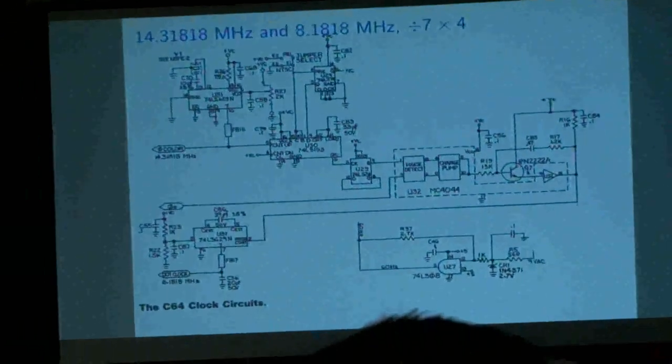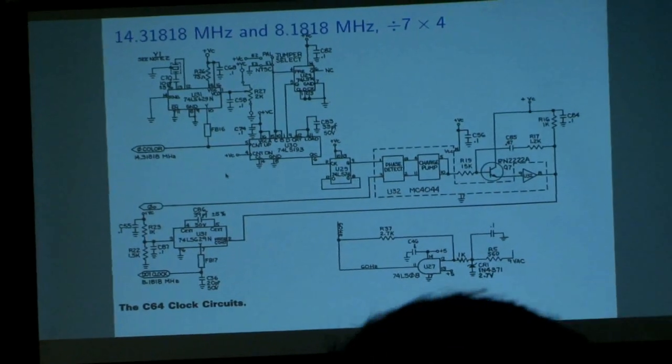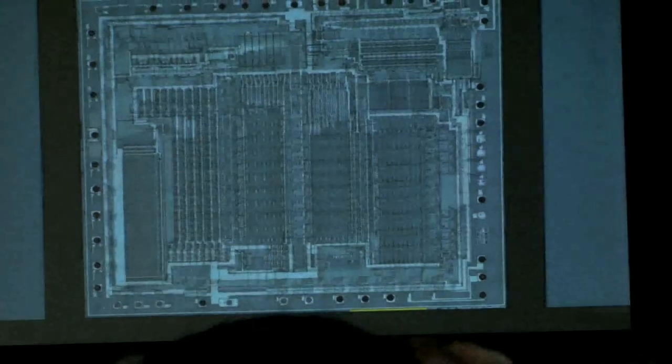You do not want this in your cheap product. And you're going into production. And you're going to have to pass certification. And so, by the way, you've got this analog oscillator operating at a few megahertz or whatever. You do have a nice disciplined crystal up here in the lower right, but all the rest of this stuff, zeners and charge pumps and phase detects. That was fun. I can still remember it.